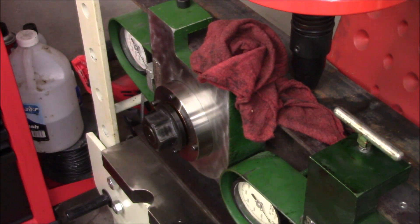Right now it would need more torque to remove something. But when I run it on and off and heat that nut and bolt up, it will require less friction — and remember, that nut and bolt is going to be lubricated. So what we'll do is run it on and off with the larger impact wrench, heat it up, and then take another reading to see how hot it is before we try to remove it with the Milwaukee.